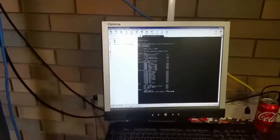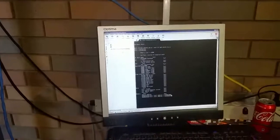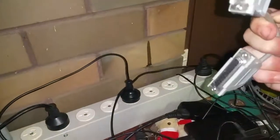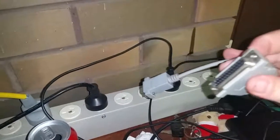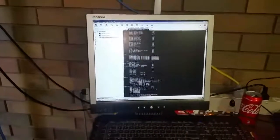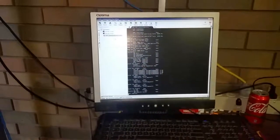But you need to be aware that if you end up with one of these metal DB25 style plugs, you create a grounding network on it. As you can see, it is booting — so there's a backyard IT version of creating an RJ45 to DB25 RS232 serial plug. In the case of doing this with the V490 using the RJ45 serial plug out, I've been putting the DB25 into an adapter and then into the laptop. So there is how to get a DB25 to RJ45 cable set up for RS232 coming off an e-server and a V490. Hope that's helped you out, thank you very much for watching, please like, comment, and subscribe — cheers!